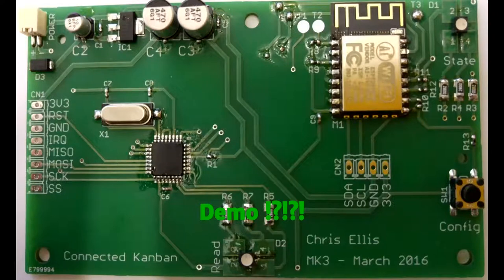In the corner, there's a Wi-Fi module — these all connect to Wi-Fi and talk up to a back-end service over a protocol called MQTT. That little chip has a whole 80 kilobytes of RAM, which is quite different when you're used to dealing with servers with a terabyte of RAM. It has interesting limitations — you can't do TLS because you don't have enough space for a certificate chain. But I do have AES encryption layered over the top of MQTT.